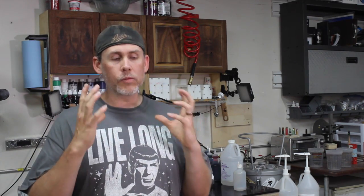One other big thing that I want to talk about with safety is the dust from the seashells is very bad for you. I'd say that it's worse for you than just wood dust or Alumilite dust or any of that. It is really bad, so wear a respirator on the lathe, wear a face mask, make sure you're protecting yourself, and I would really recommend probably not cutting these things on a table saw.